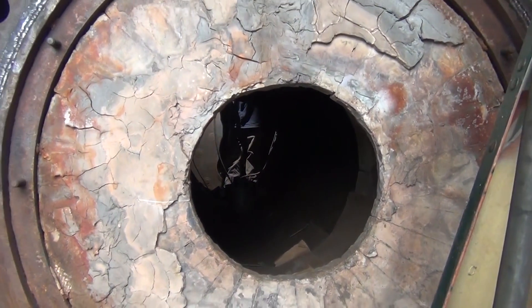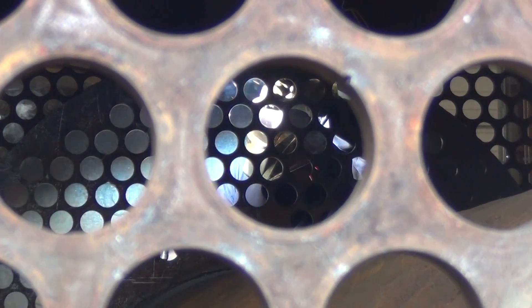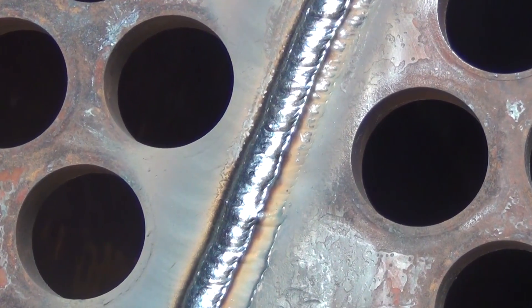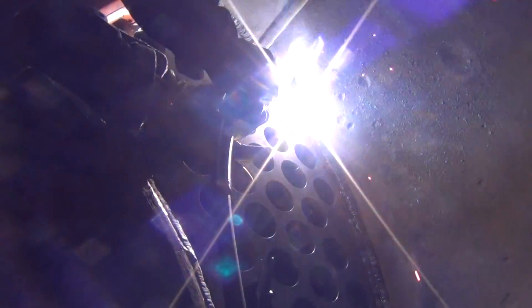Along with the amount of welding required and the ASME procedure, several hours will be spent by certified welders fusing the void between the sheet and the vessel. A proper weld is not simply filling the gap with metal. The two surfaces to be welded are brought quickly to a temperature that creates molten metal, which is then pooled and mixed with the weld metal to create a fused solid surface. In most cases, with proper techniques, the welded area will actually be stronger than the base material itself.